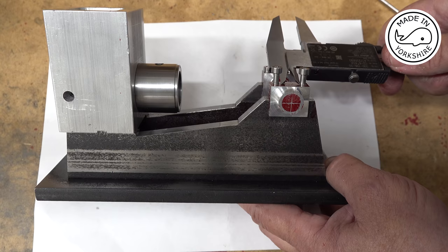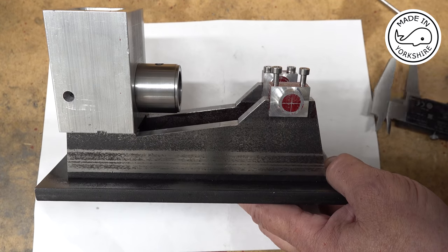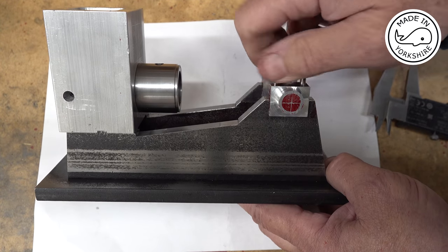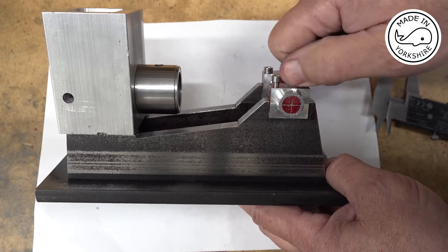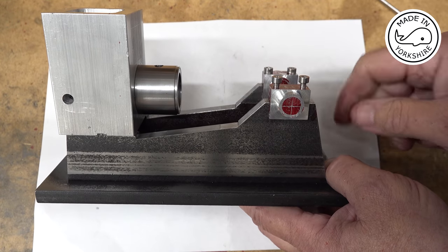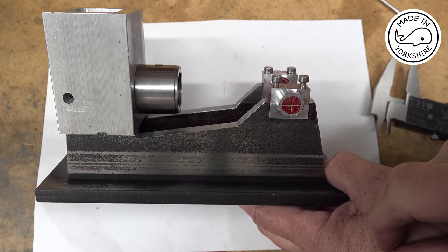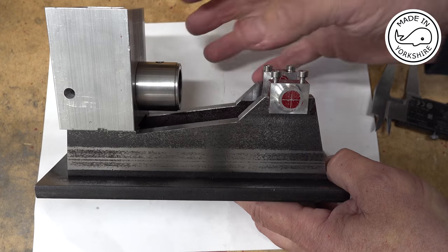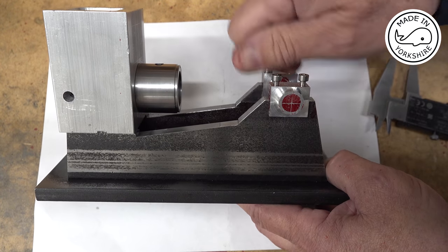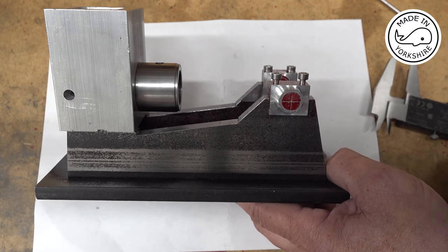I think Earl had issues. He caught the edges of his bolts, but I think he used probably slightly larger bolts. And once I've reamed through half an inch, I'll put some bronze bushings in and then have another ream through at, I think, 3/8 of an inch. But that needs quite some accurate setup on the mill, so I think I'll quit for the day while things are going good, and I'll get back to it tomorrow.